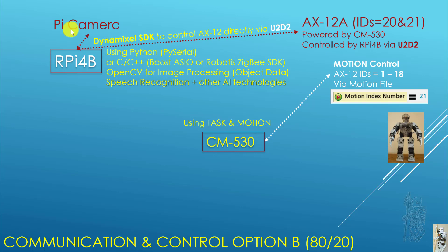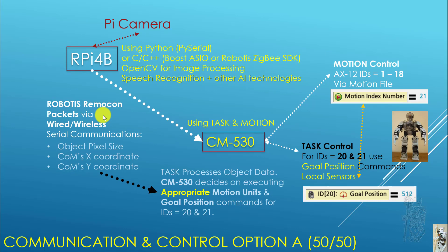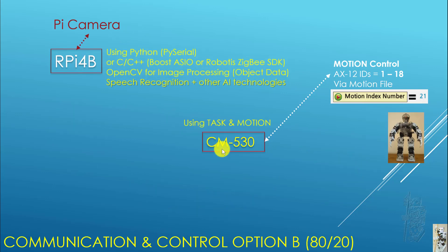Why do we want to do this? For example, if you have a pan-tilt platform with the Pi Camera sitting on it, you'll find you get better integration and better response time between the Pi Camera and how you aim the camera to look for something or track a moving target. Or you could use the Pi Camera to see if your arm is up to the level of whatever you're trying to grab, then close the gripper. This is much more responsive than Option A for applications that need it. The direction of data in Option A was mostly one-way — from the RPi to the CM530 — but in this new option that changes.